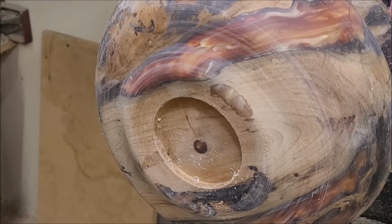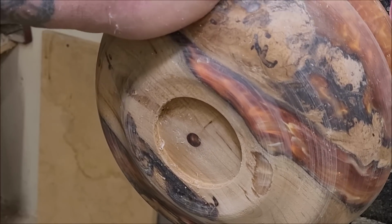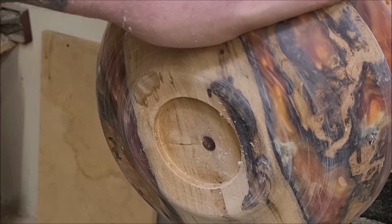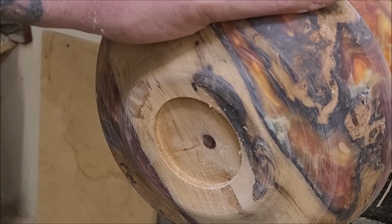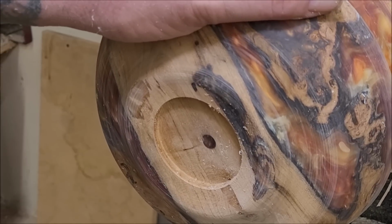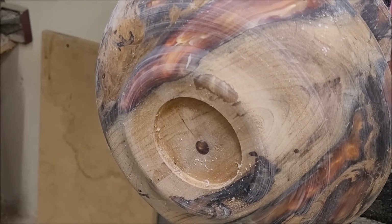I'm gonna sand 80 grit to about 800 grit. I'm gonna put some sanding sealer on it, hit it with a Scotch-Brite pad, and then I am going to put, oh, let's try, everybody tells me why don't I use it anymore. Because basically it wasn't staying on, but I'll try it again, just for you guys. Shine juice. It may have had something to do with the abrasive paste. Could be. That might be why I quit using it. I don't remember, so let's see.